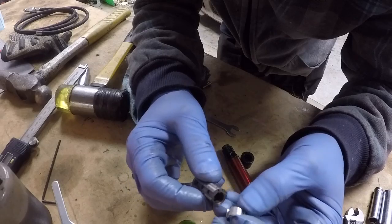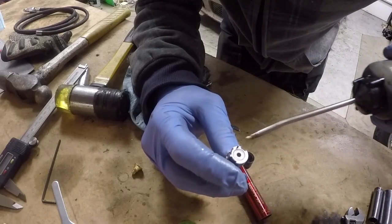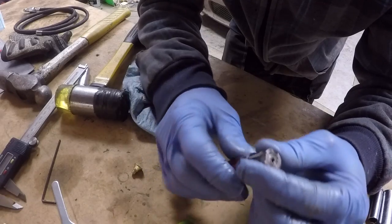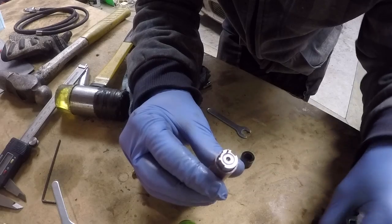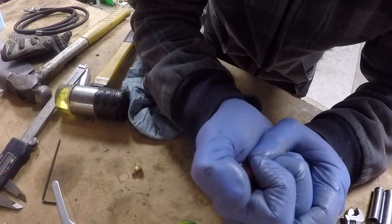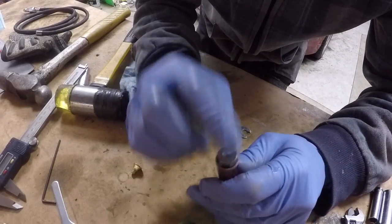Actually I will start with these two pieces — we have got the bearing on the outside. I will put a little drop of oil on that bearing. Now again, this can go in there any way, it doesn't matter, but these pieces have to be lined up with each other. So I have slid that in and it went in a whole lot easier than it came out, which is good. I will put this last piece on and continue sliding it together. At some point it is going to take a hammer to get this all the way in. We have to make very certain that all these pieces are lined up.